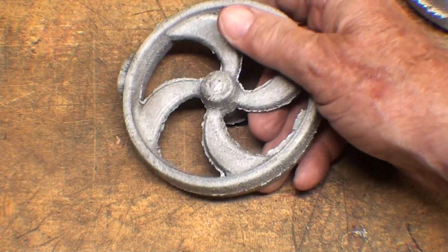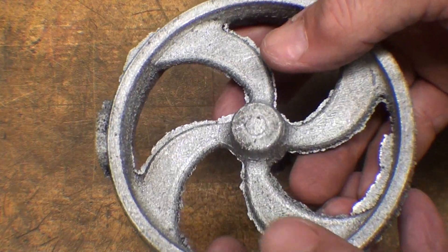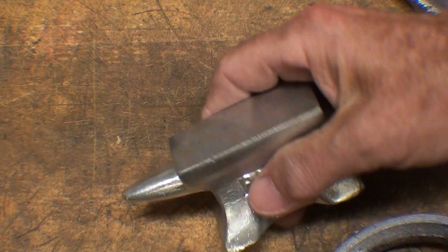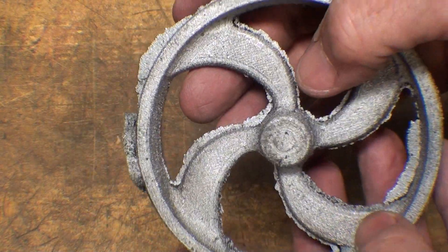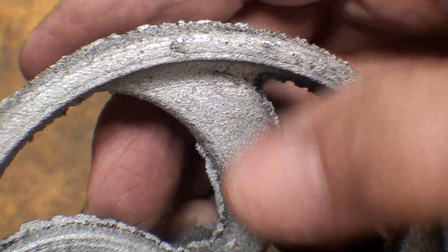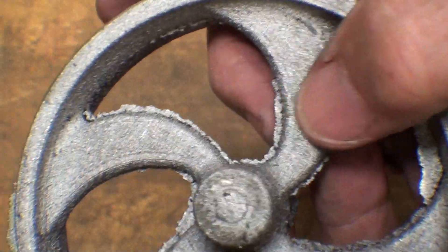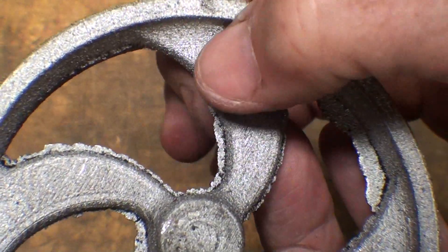Let's have a little analysis and criticism and praise. By 1968 when I was teaching, I sometimes had the freshman class make little anvil paperweights, and the advanced classes made it with cast aluminum. But in the beginning classes, because some of these guys were 13 or 14 years old, I had them use lead. And right away I noticed that using the same molding sand, the texture and finish was so much rougher than it was with aluminum. I've always deduced that was due to the mass and weight of the lead taking more of an imprint into the sand.